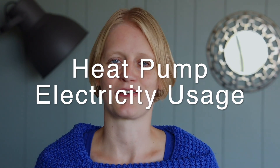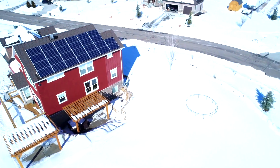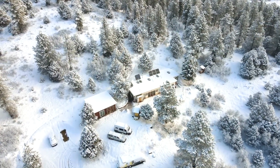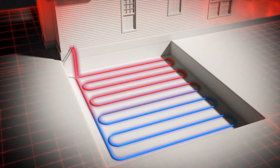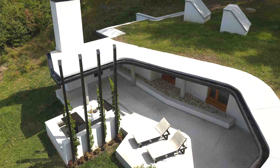So how do you estimate your heat pump's electricity usage? At the end of the day, it all comes down to the heating and cooling load, typically measured in British thermal units — BTUs. In cold climates, the capacity of your air source systems, both air to air and air to water, should match about 99% of your heating and cooling load. Why not 100%? Because typically you don't want your system to cover the two coldest days by far. For those days, your cold climate heat pump has a backup resistor. Ground source heat pumps don't need a backup since there is a steady temperature below about three feet or one meter underground.